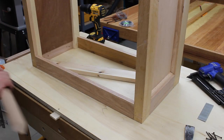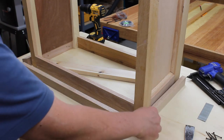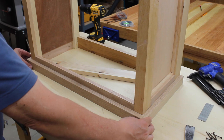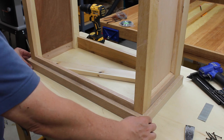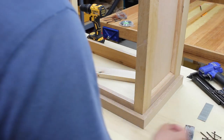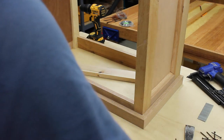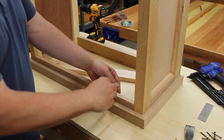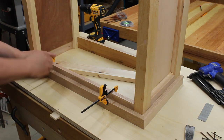So I have the moldings in on the panels and now I'm going to work on the molding on the front — this is the base of the front. I thought I would just put a nice piece of one-by-two down here and miter the corners. Since we have a little bit more to grab hold of, I'm going to put screws in from the back side so you don't see any nails in the front. I got these tiny little DeWalt clamps from my kids for Christmas last year and they work really well for these small projects — they really hold well.